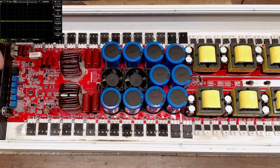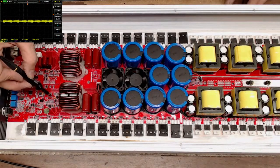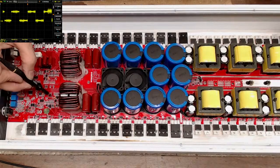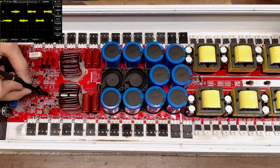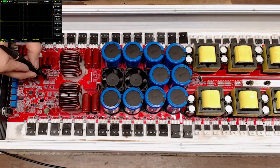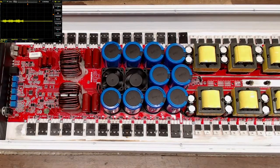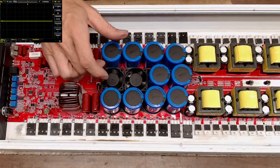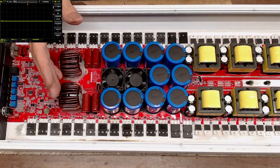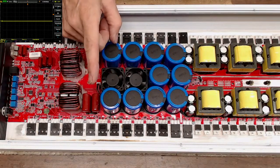All right, so back to where I was at. I am on pin 3 of the drive ICs, and sure enough, the blue light's blinking, which again, we will get back to. Pin 3 has drive on both sides. What you're looking for is that square wave with no undershoots, overshoots, no excessive ringing or whatnot. You want a nice, clean square wave. So knowing that that's pin 3 and not pin 1, that's a huge difference.